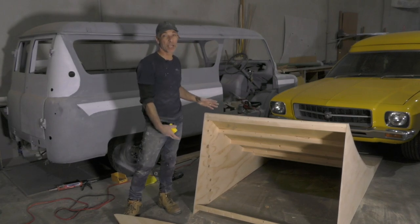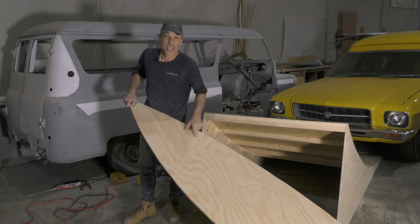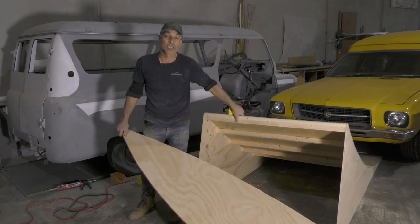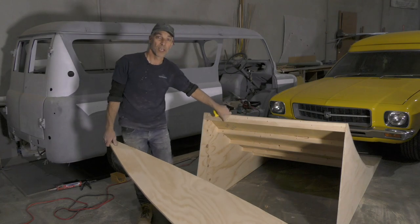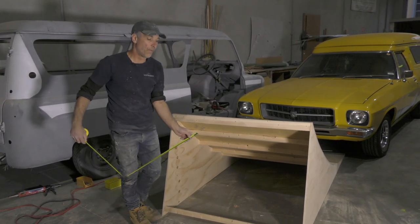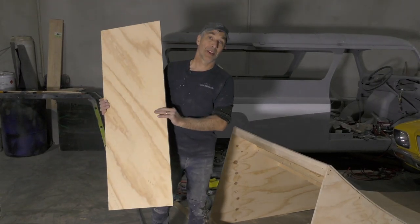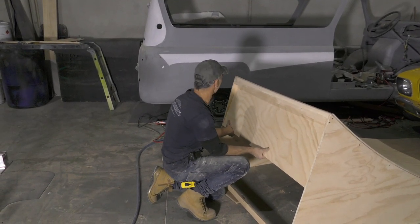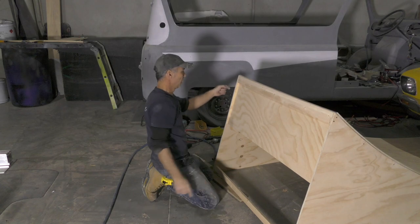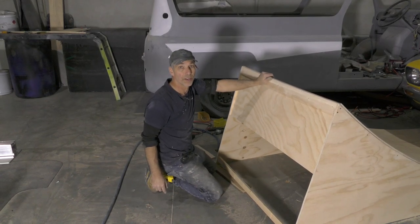It's still a little wobbly so we need to make a bracer. Using the 12mm offcut from the side pieces, we cut a rectangular piece 1176mm wide by about 400mm tall. We slide it underneath the top section and screw down through the top pine piece and three screws each side into the 12mm. That has already made it a lot more sturdy.